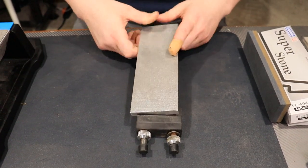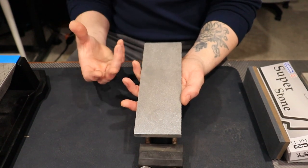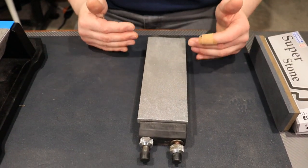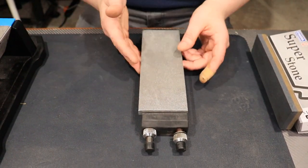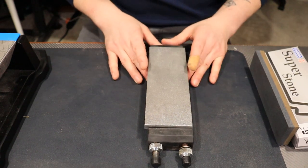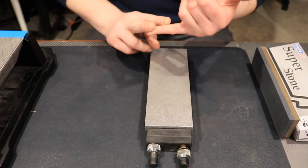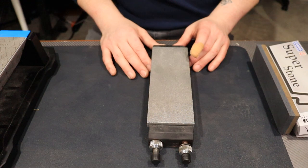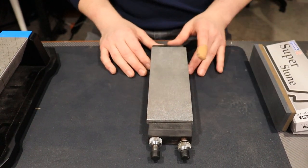Next is diamond plates. These are my most recommended. They work for any steel, including super steels. They cut really fast and in my opinion they leave a lot of bite — they're especially good for super steels. They can run expensive, but you can also find very affordable options depending on the brand, size, and grit. I have a Neves Knives store down in the description with my most recommended diamond plates. One thing I really like about these is you can use them dry. You can use a lubricant like water or soapy water, but if you don't want the mess, just run them dry and wipe with a towel. No maintenance. They're very easy to use and have a lot of feedback, so they're easier to hold the angle when sharpening.